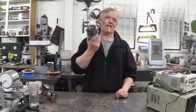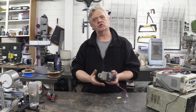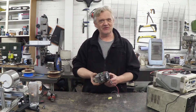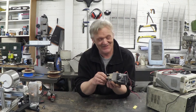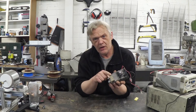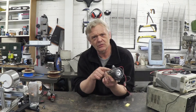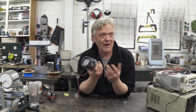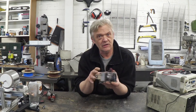I wanted to talk about this universal motor. It's called a universal motor because it'll run on AC or DC. You find this absolutely everywhere — it really is a useful motor, easy to adapt. I got this one from an old vacuum cleaner. In Europe and the UK you find this kind of motor in washing machines. In the US you usually find an induction motor, but you'll find universal motors in power tools, hand tools, and vacuum cleaners.